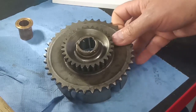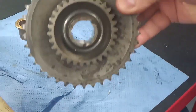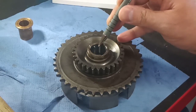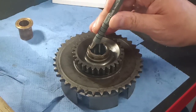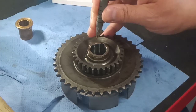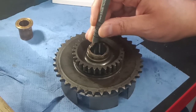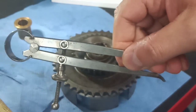This clutch drum has a bit of an issue as far as measuring the bore is concerned — there are three slots machined into the bore. If we're going to measure this bore we want to go diametrically opposite on the bearing surfaces with some sort of an instrument. The problem is that these slots are machined directly opposite each portion of the bearing surface, leaving a very small target area. Something like a snap gauge wouldn't really work because you'd be half into the slot and half out, giving a false reading. That's why I've decided to use internal springbow calipers.